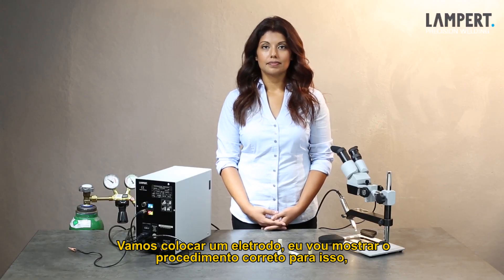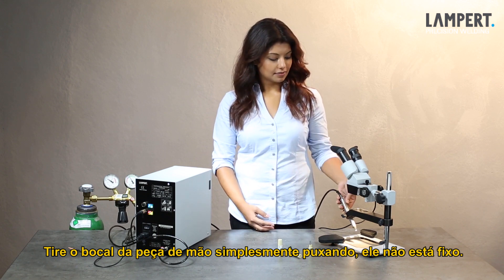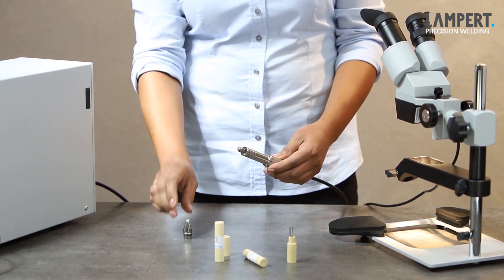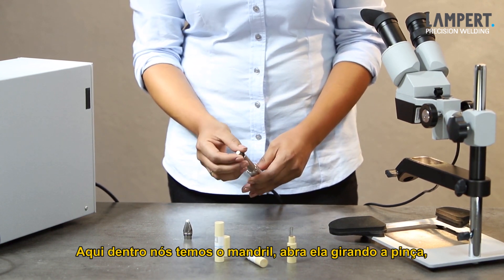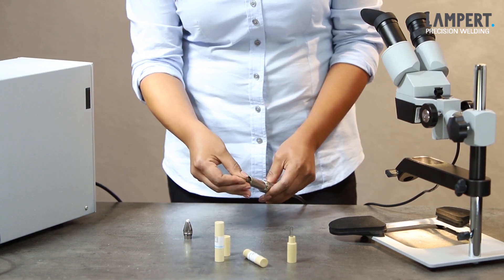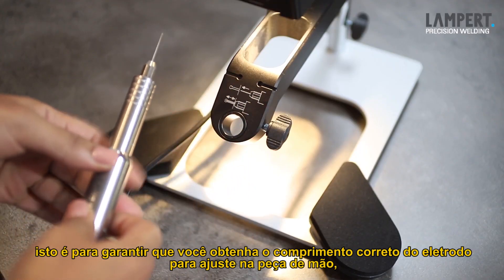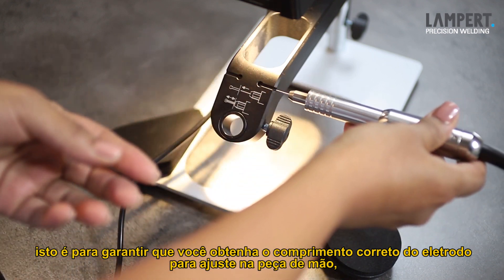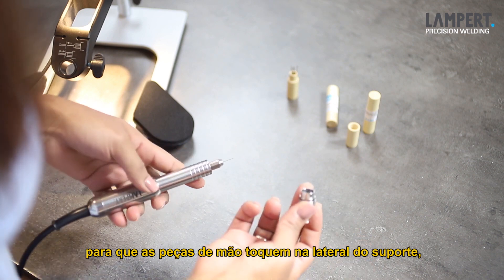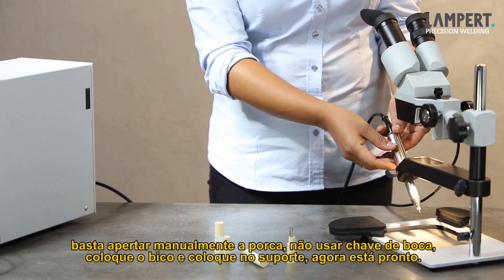Let's put in an electrode — I'll show you the correct procedure for that. They're all double-ended. They are sharp, so be cautious. Take out the handpiece. This front nozzle we simply pull off and set aside — it is not screwed. Inside here we have a chuck. Open it with some turns. Grab one of your electrodes and just pop it roughly into place. On the holder we've got two little slots — a slot on the right hand and a slot on the left hand. This is to ensure that you get the correct length of the electrode protruding from the handpiece. So don't fasten it just yet, put it quite loose. Put it onto the groove here and push up with your handpiece so the handpiece touches the side of the holder. That is now the correct length. Then simply hand-tighten the nut — do not use a spanner. Slip the nozzle back on and put that into the holder. And that now is all set.